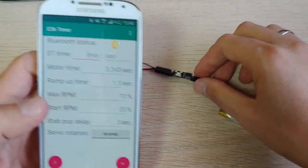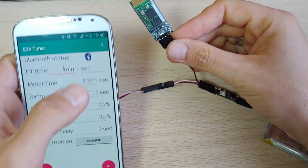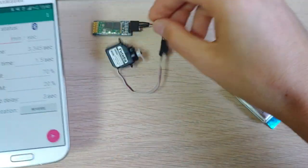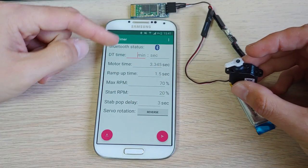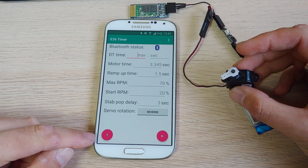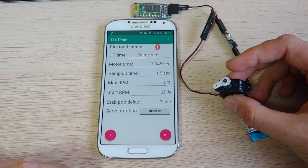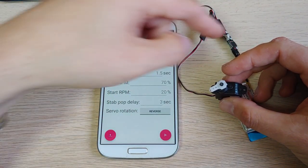In this app, I already paired the Bluetooth. You can see it's yellow — it's connecting. And now when it's blue, it means they are connected together. I did the pairing previously before I started this video. Here you can see all the configuration data fields for the timer. Right now you can see they are all empty. The button on the left is upload — that means you can upload the data from the timer to the phone. The other one is send, so you can send all the data from the application to the timer.